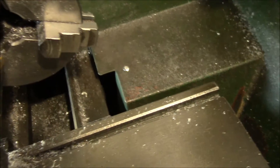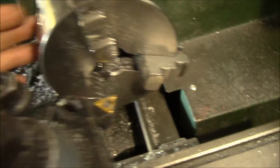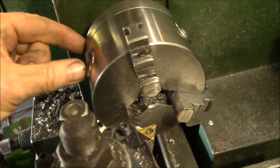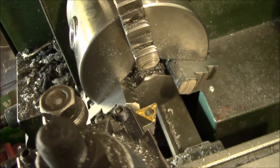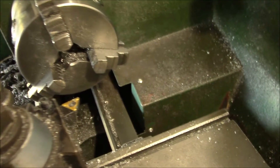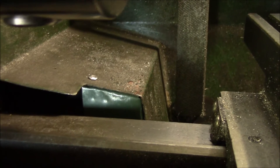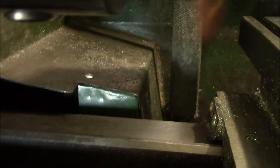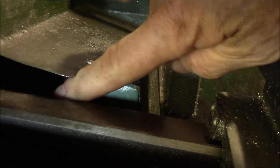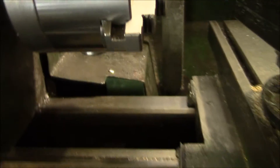The reason you need clearance there is for the carriage to go back, so you can't just block it off completely. Depending on what kind of chuck you have — especially if you have the faceplate on — you can go in a lot closer, and that's why you need that clearance. Hopefully this will solve the problem. Everything in here will fall straight down beside the motor and keep everything out of the fan intake.